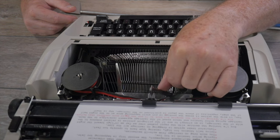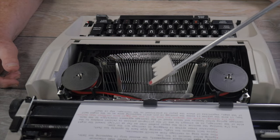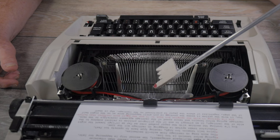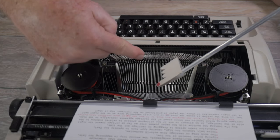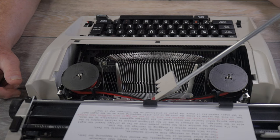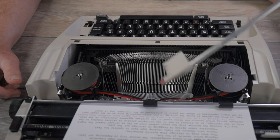Once it rebounds off the platen, there's a second trip. It looks like that second trip is happening quite a bit further back from the platen than the initial trip — maybe too far back — causing the carriage to still be in motion when the next key comes up to type. So maybe that secondary trip point needs to be adjusted.